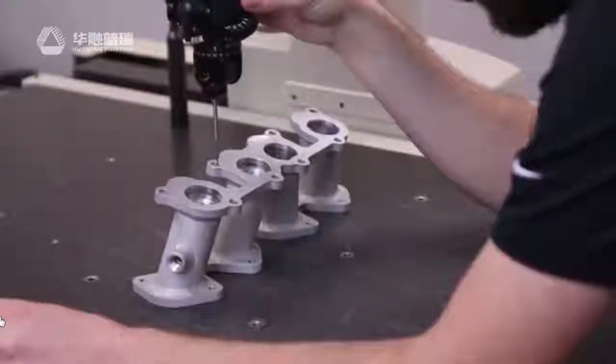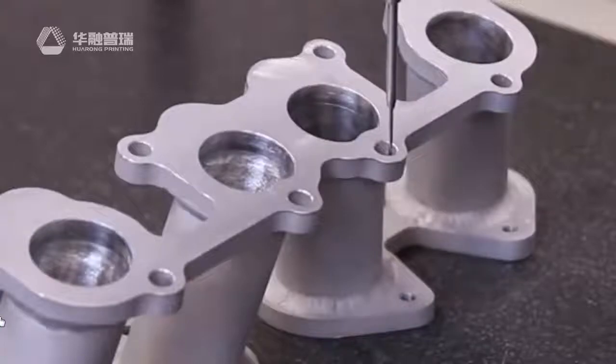So, in order to get to the straight tube runner to keep costs and time down, I was able to model these nifty little templates that clamped onto the tube and allow me to just go in with a band saw right up against the nylon. The nylon didn't budge. It made nice clean cuts. All I had to do was deburr and blow off the tube, and they were ready for welding.